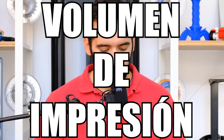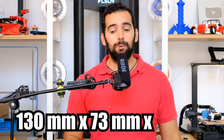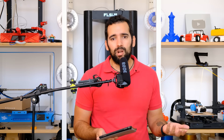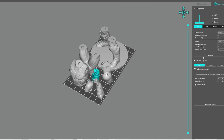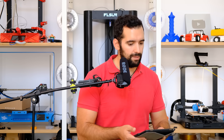Second negative point: the print volume. We have a very, very small volume — we have a printing volume of 13 cm × 7.3 cm × 16.5 cm high, which is very little. It is not the smallest printer I have seen in my life, but it is smaller than a normal Anycubic Photon. I suppose it has something to do with the DLP technology, as the projector has to be a little bigger. Many people use resin only for miniatures and with this volume it will be fine, but for example the Batman had to be printed in two parts.